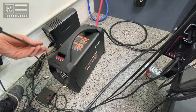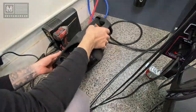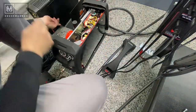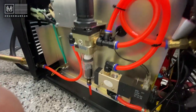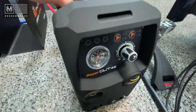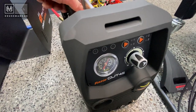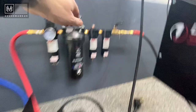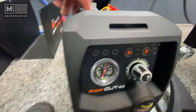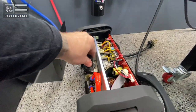So I'm going to take apart the Razor Weld 45, which is the plasma torch itself — the cutter, the piece that sends the electricity to the torch — and I'm going to adjust the internal regulator to allow a little bit more PSI. When they come from Razor Weld, they don't have an outside adjuster for the PSI. It's just set to 65 or 70 PSI right from the factory, and without opening up the case and adjusting that, you can't get any more PSI. I have an HTP air drying system on the outside of the Crossfire Pro table that dries the air on the way in, and that has a regulator on it, so I'm able to adjust that regulator and allow for the correct PSI.